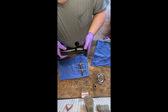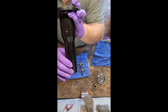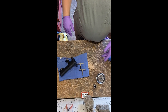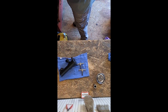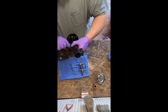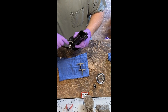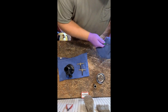Now on the PTO housing, you're going to see on the bottom a small hole. A lot of people ask about it — what's it there for? Is it a defect? Do I need to plug it or seal it off? No, you don't. We need to keep it clean actually. That hole is there to allow expansion inside the PTO housing to let out excess grease or water that may get into the housing.